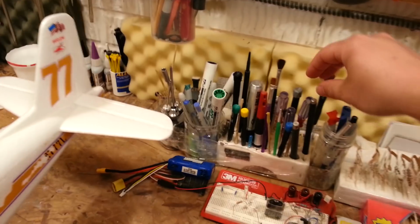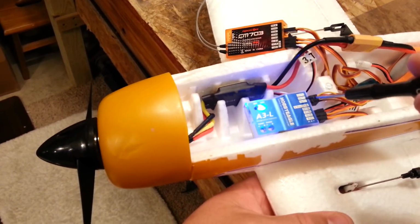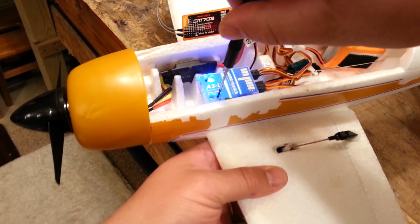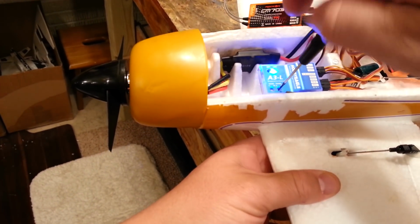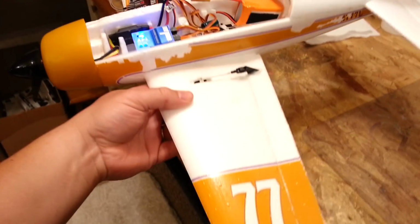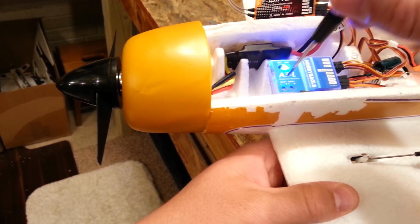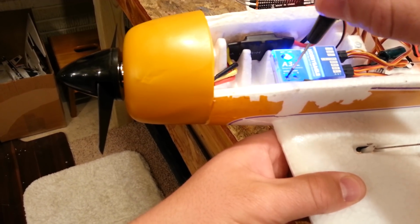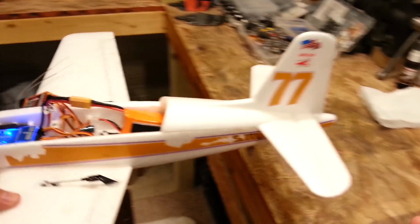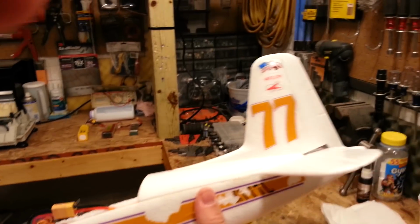And you know what? I'm going back in my memory bank here and I'm remembering that the gains are in absolute position. So gain one, gain two. I'm gonna turn the gain all the way up on one of them. See how it's going the wrong way? Now I'm gonna go all the way down with it. Yep, still going the wrong way. So my experience is it's always easier to turn the gains way up to try to get the behavior to be exaggerated. That way you can see what direction things are going, okay?